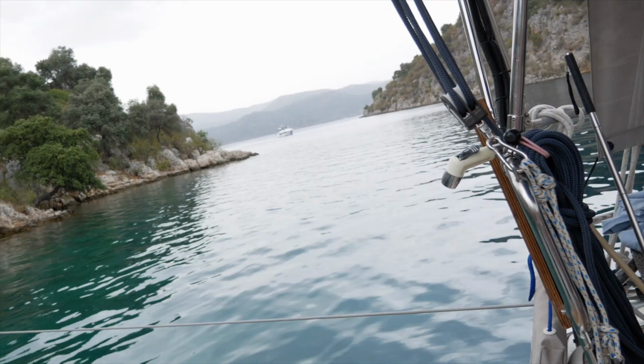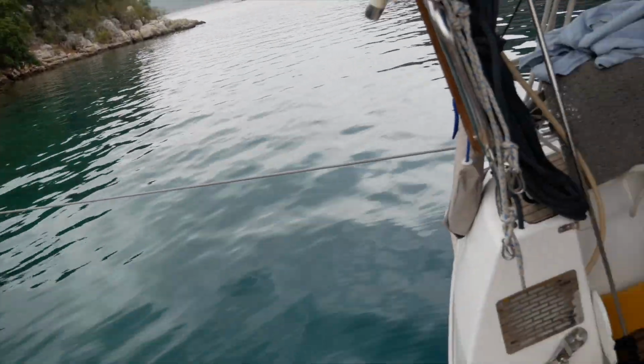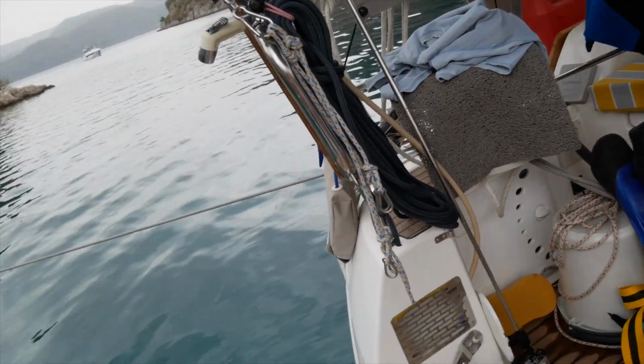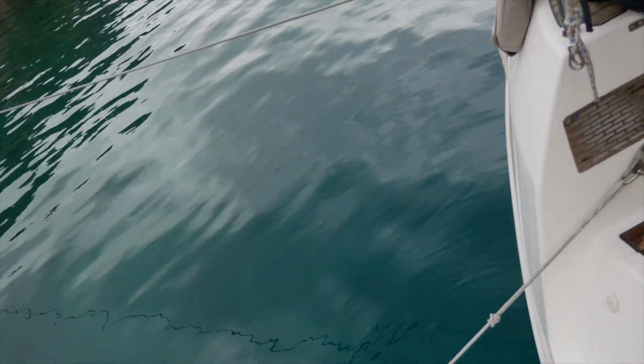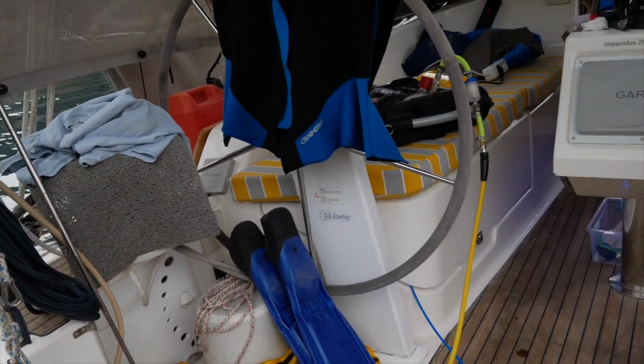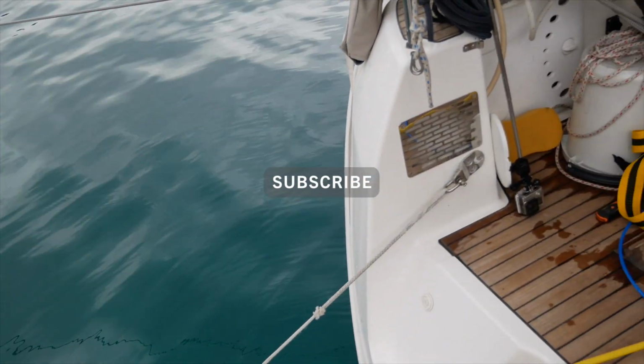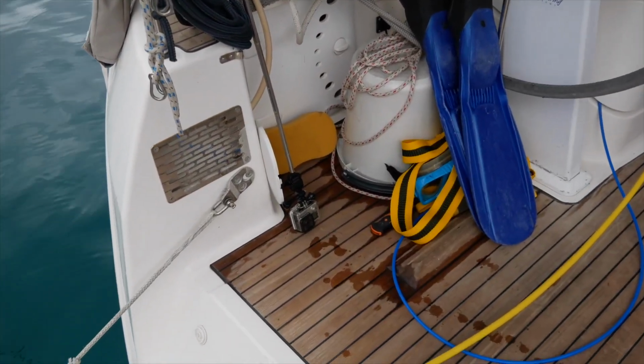so like paying out line or paying out cable, you should always spool it out, not take it off the side of the drum, because you'll induce twisting. And that's what we've done here, because we had to coil it up. So a swivel would have taken that out. But there we go. Had the GoPro down.